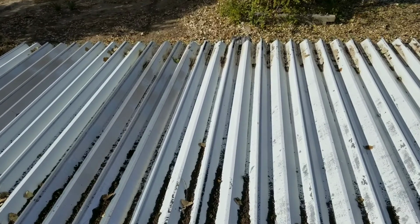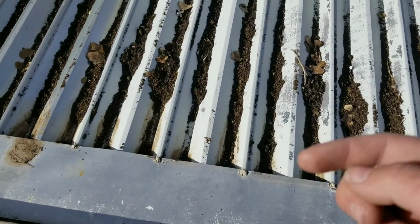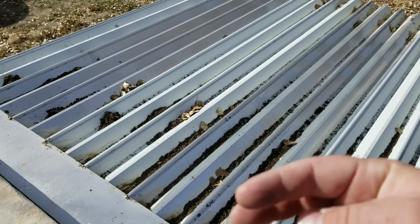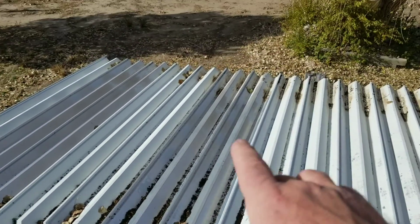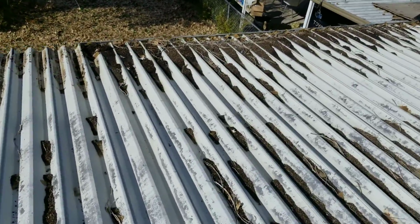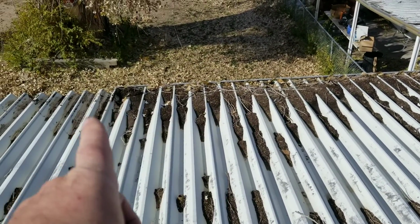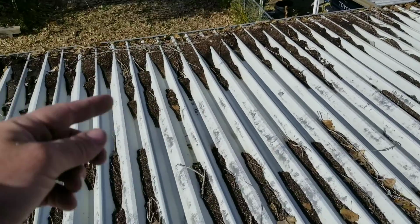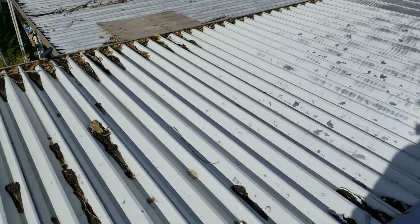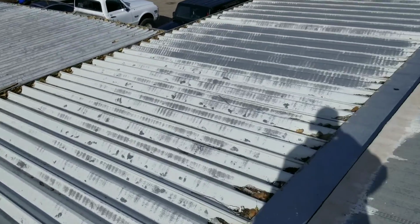Unfortunately, you can't walk on these roofs. They're just an awning. So I started pulling all the dirt back from out of here to try to get it to drain, because these things are just damming up water. They're piling it backwards. And we pulled the fascia off and cleaned it, 20-foot fascia right up to here. This is a pretty long, I think like 60-foot awning. So you can see, this is where I haven't cleaned yet. All the mud is backed up and the water's backing up to the house. So I gotta come through here, clean all that stuff out, and I've gotta pull all of that fascia in order to get that gutter cleaned.